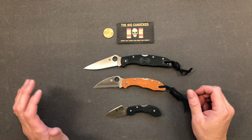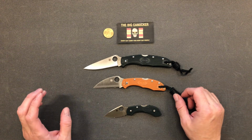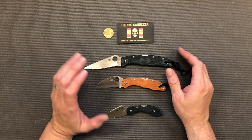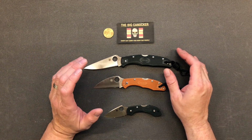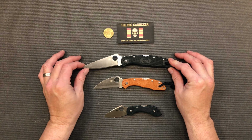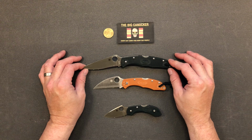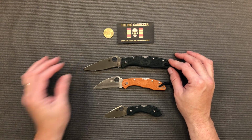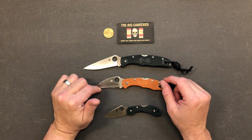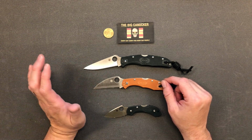Now, the Hap 40 in its own right is a great, fantastic steel. It's kind of a Japanese version of Rex 45. Now, let's just say here, watching Cedric and Ada, Pete down in Australia doing all these knife tests, I don't remember the actual number whatsoever, but when this ZDP 189 is a mirror polished KME edge, it's something like high threes, I think, on his twisted sisal rope. He's somewhere around 380, I think, something like that. Whereas the Hap 40 Rex 45 is going to be the high twos, low threes. That seems to be the way it is.